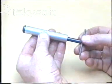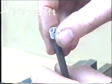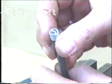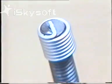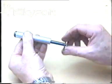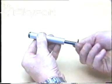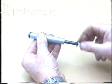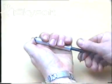Remove the mandrel from the body. Pop the insert over the threads. Engage the tang on the driving abutment. Replace the body and wind the insert into the pre-winder until it is flush with the end. A useful tip: put your thumb over the end of the nozzle to feel when the insert reaches the end.